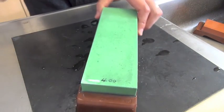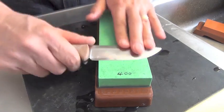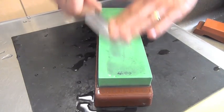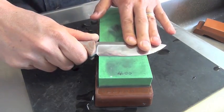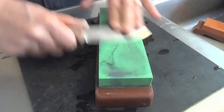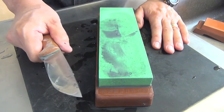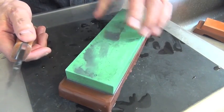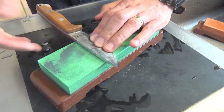We should not soak these quality ceramic stones in water. From a high line, I need to hone off the chips. Stropping will just increase the apex angle. So, this hard plane honing, elimination of the chips, is necessary, not to increase the apex angle.